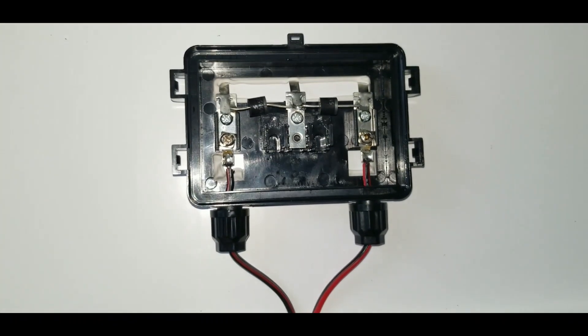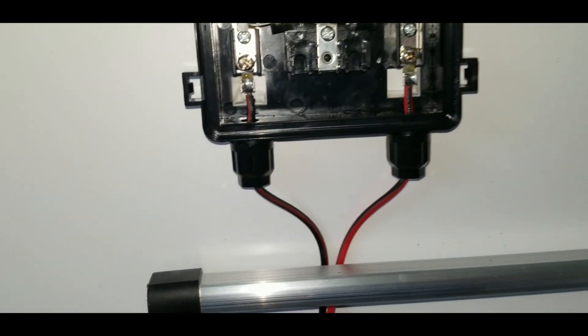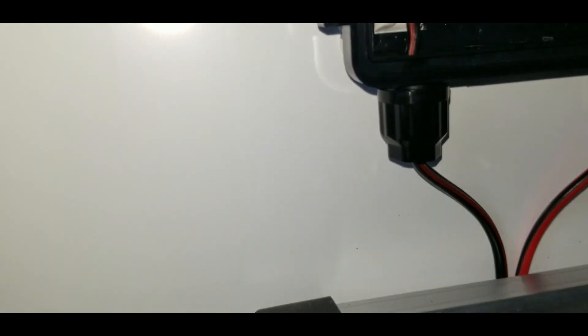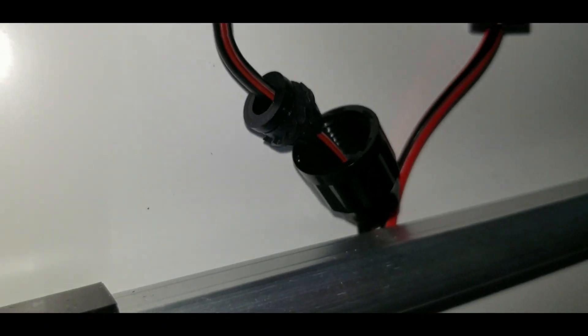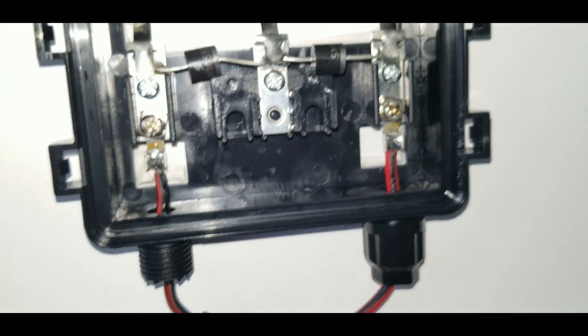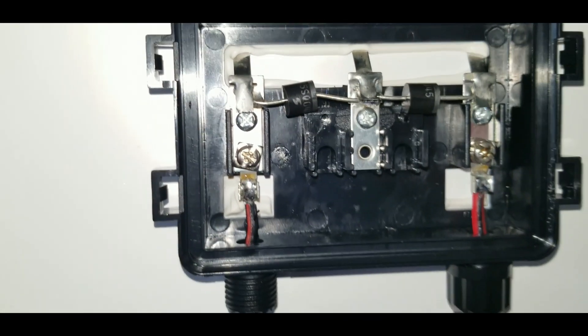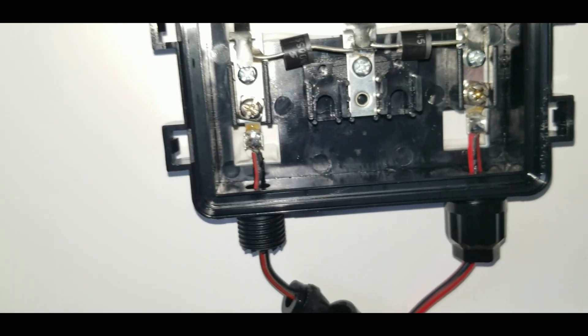If you're expanding your solar setup, these cables may not be the best to run at higher voltages. You can take one of these connectors off to see what's underneath — it's just a regular twist-lock with serrated teeth and a rubber gasket, which gives it the waterproof rating. You can probably unscrew the whole wiring harness assembly on both sides and replace them with MC4 connectors and thicker wires, which should theoretically increase voltage capacity and improve heat dissipation in the line.